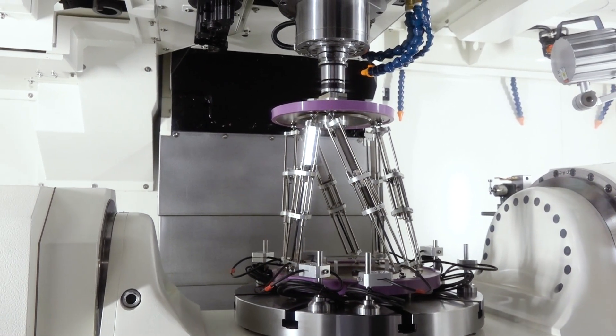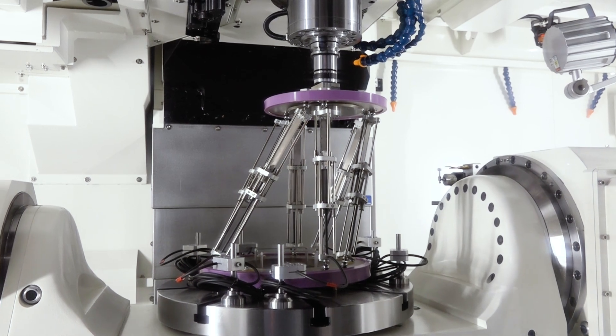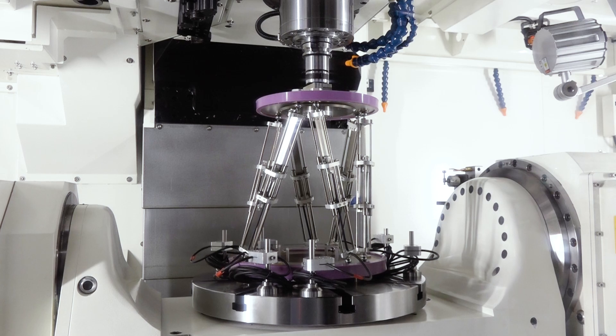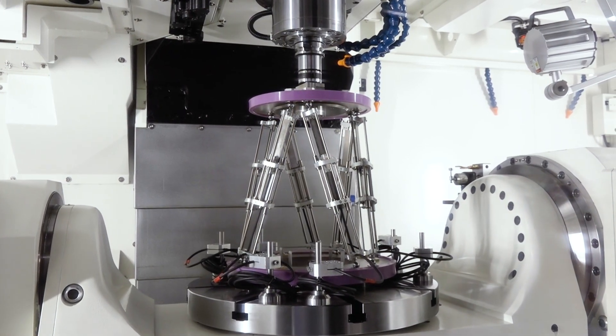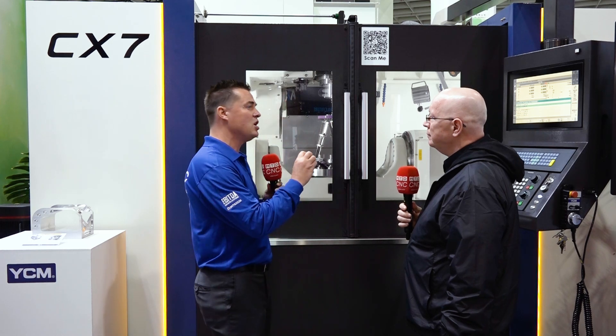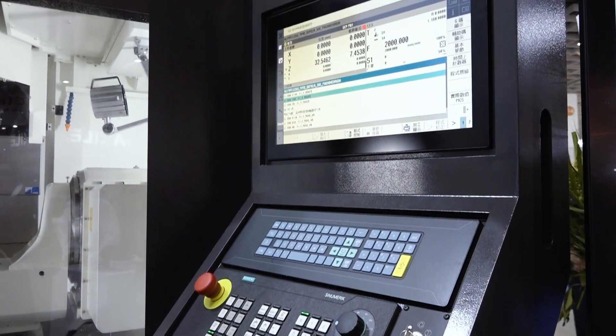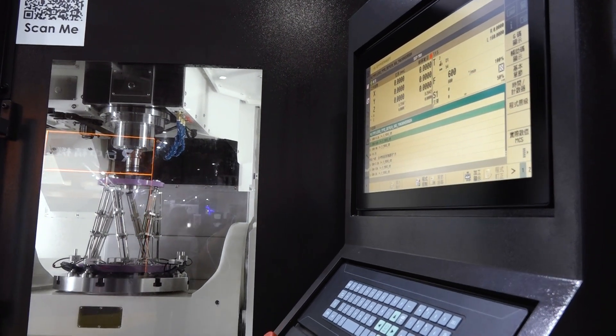This machine — what I'm seeing here, Jeff — it looks like I'm not taking a third source and adding my trunnion table in there. But also, when I think of a trunnion table going from a three-axis to a three-plus-two, I think immediately about my Z axis loss. The T13 series machine actually has an upper Y axis, and that upper Y axis gives us the ability to have a very flat part corner to corner. That was actually a patent by YCM a few years ago, so that's something special for us.